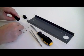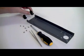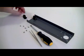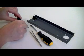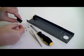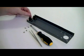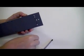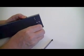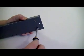Fit a nut into each of the four hexagonal recesses in the black shaft fixing bases. Position the fixing bases so that the nuts are above the corresponding holes in the metal Y gantry bottom cover. Insert four bolts through the underside of the gantry cover and into the nuts. Tighten the bolts with a Phillips-type cross-head screwdriver.